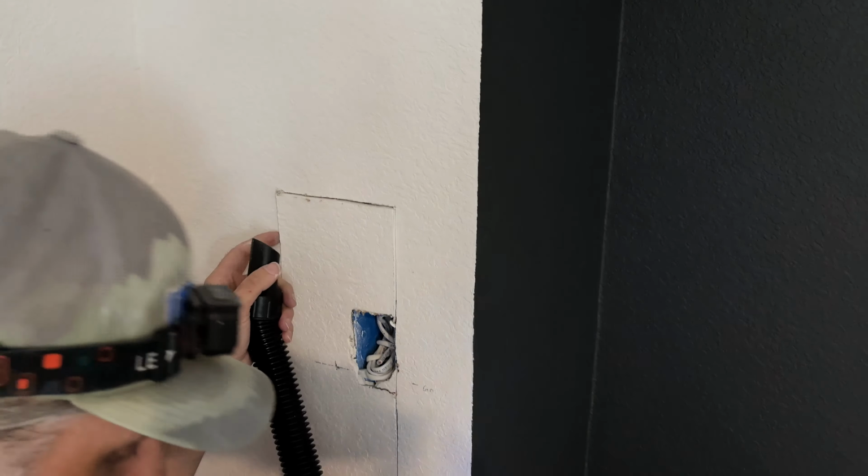You can angle the tweeter here. So if you need to go up, down, left, right, you can do that right there. And we're putting the tweeters at 60 inches over here for the LCRs. Since the in walls are a little different, those are gonna be right back here. So it actually come down a little bit, so that'll help out.